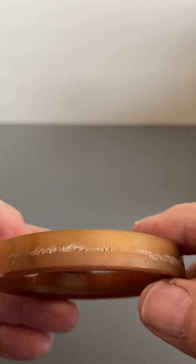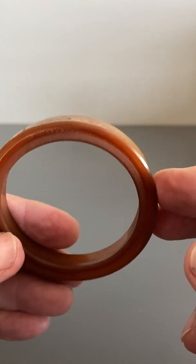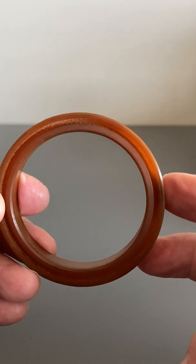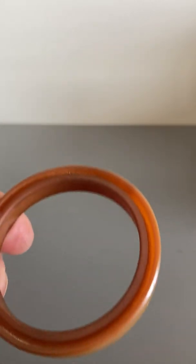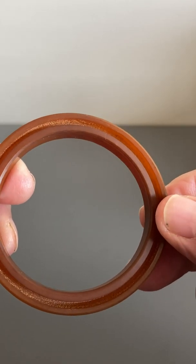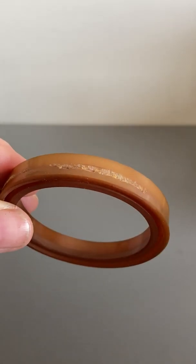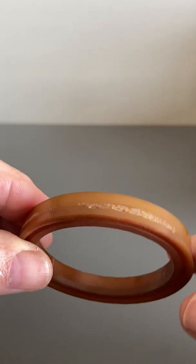This one has to be replaced because you can see there was some pick-up on the edge of that seal there, and it's quite a significant job replacing these. So what operators do is pull the whole ram off and get a replacement ram. The properties of a hydraulic seal are: it has to be flexible, resist hydraulic fluid, have a high tensile and compressive strength, and also a low coefficient of friction when moving against the inner wall of the barrel of the hydraulic cylinder.